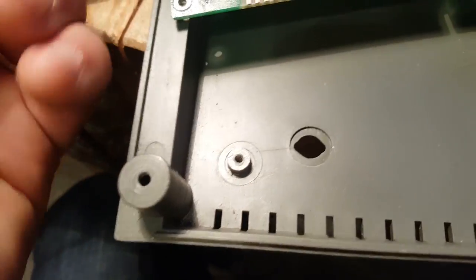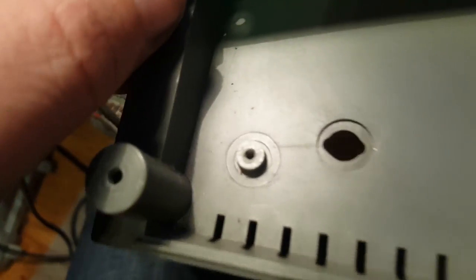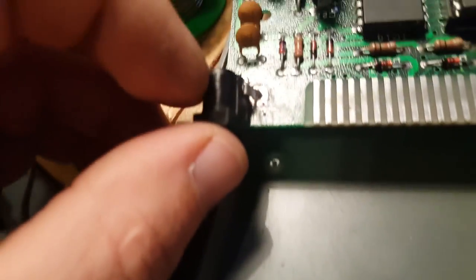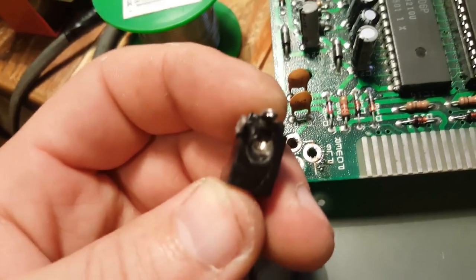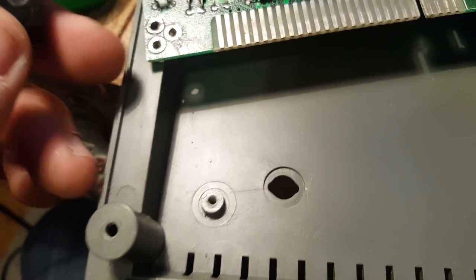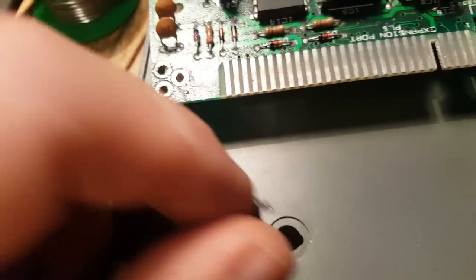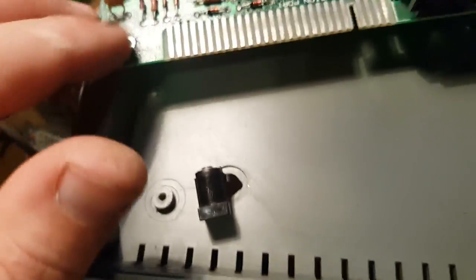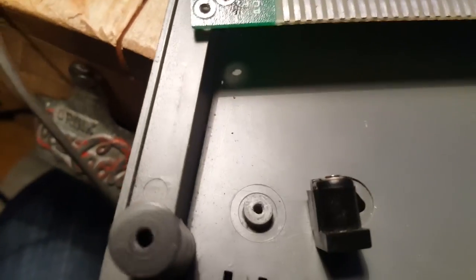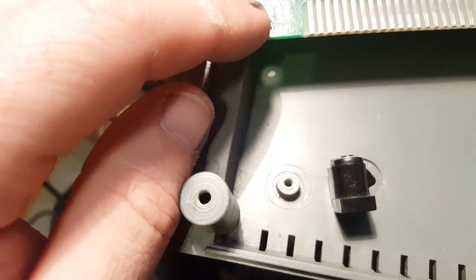I realized something was dodgy. These two pins were visible and accessible from both sides, but the middle one is actually under the socket — it comes out from underneath. It had broken off and was only making contact when pressed. So I'm taking this out, cleaning things up, and ordering a new one.